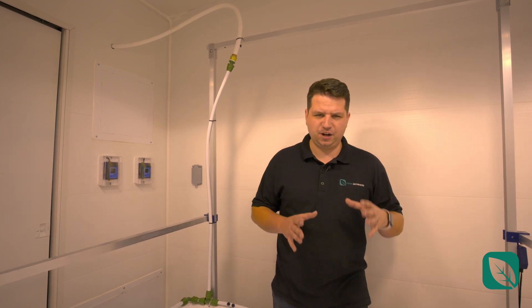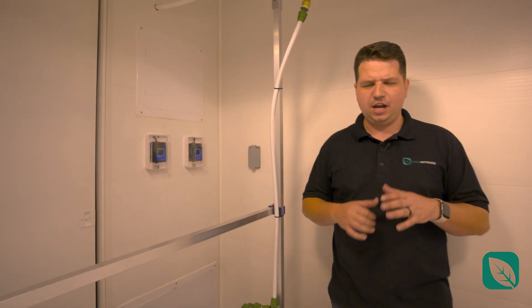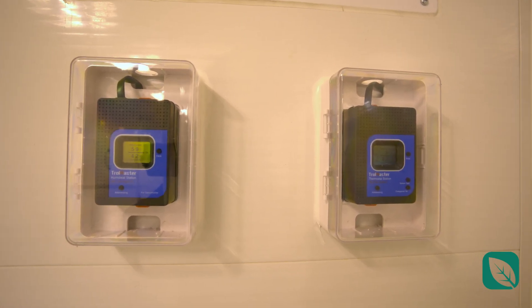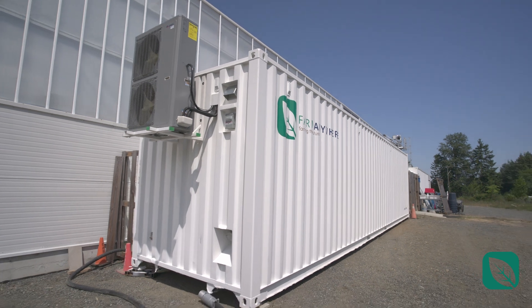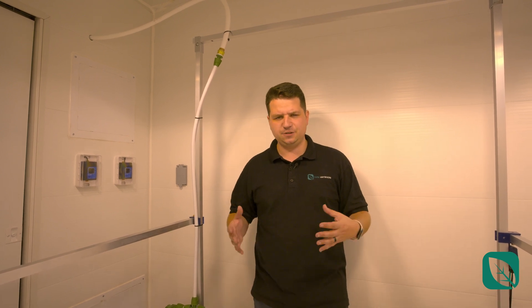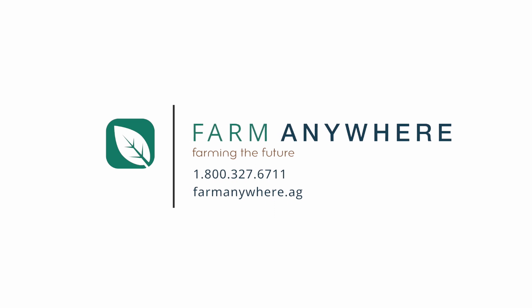All the brains and mechanical components that make this work are located behind this section here. Temperature and humidity sensors and controllers are all located there in the inline HVAC system, which also has dehumidification and humidification built into it. We don't have any separate dehumidification system in the room — it's all built into one cohesive unit, which saves on labor and maintenance by only requiring you to maintain one traditional HVAC system.